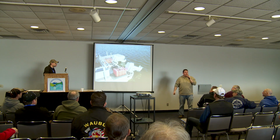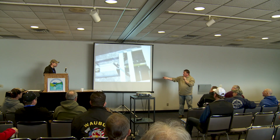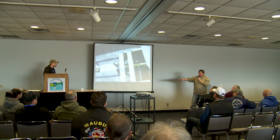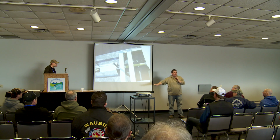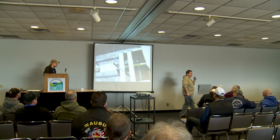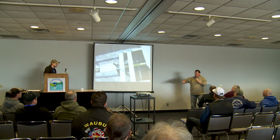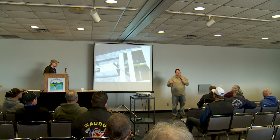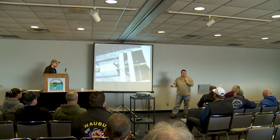So this is gravity fed. As you can see here, there used to be a pump that he used, but the elevation is probably 3 feet higher than the actual level of the water. He just uses a 2 or a 1.5-inch quarter-turn ball valve. He's got it now rigged up where he can sit in his chair and actually operate the quarter-turn ball valve as he's applying chemical, or let's say he's in a corner and turning where he needs to terminate the valve, he can just shut it off. There's no pumps to deal with. It's a pretty easy job to clean up too.